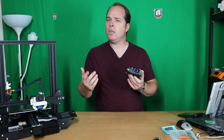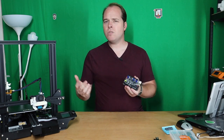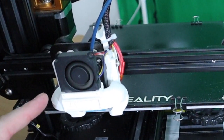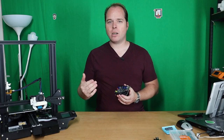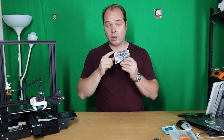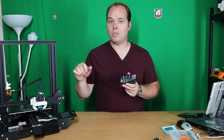If you have an Ender 3 Pro and you used one of my videos to change the board into the BigTreeTech version, try to look at what your parts cooling fan is doing, because your parts cooling fan should turn down if you change the value from 100 to 0. Then you know for sure which fan is going to turn off, because when your stepper motors move, the drivers on your BigTreeTech board are going to get warm and hot. So there you need the fan that is down on your controller box. So in this video, I'm going to change that.